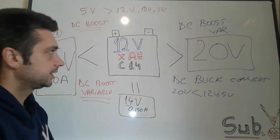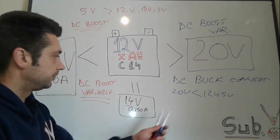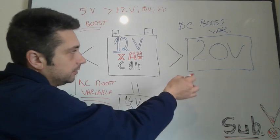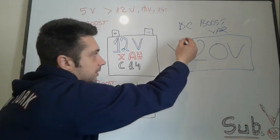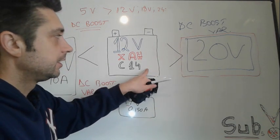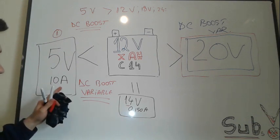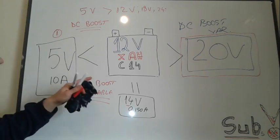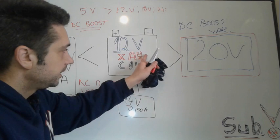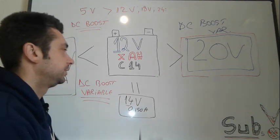All these devices are inexpensive — just a couple of bucks. As a tip, when developing your power supply setup, aim for the biggest potential difference between the source and the receiver. Be aware that in the process of stepping down the voltage you will sacrifice some amperage as well; some energy will be lost as heat during the voltage conversion going into the battery.